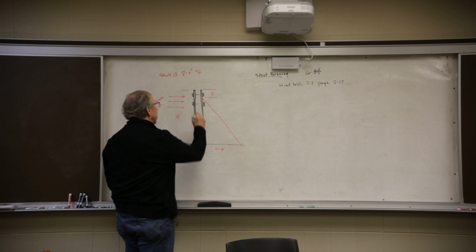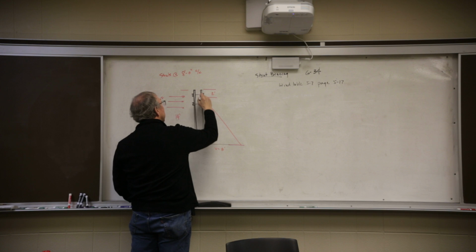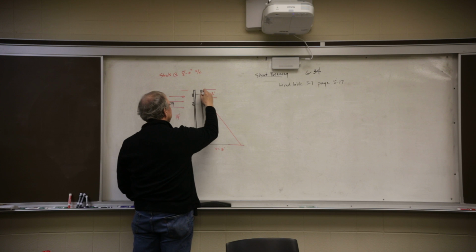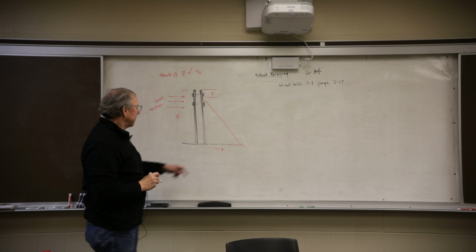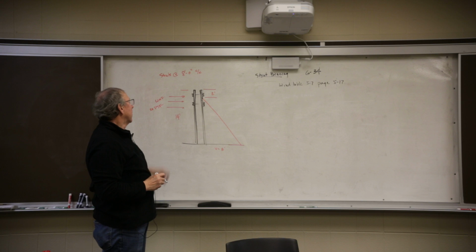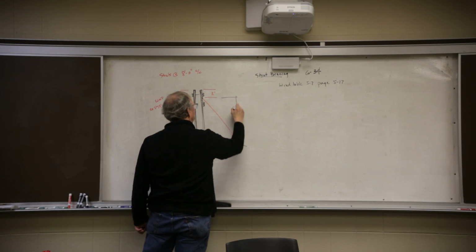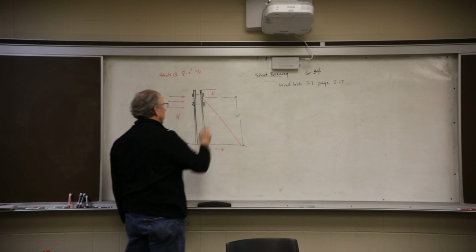So there's our strut. In this particular problem, the strut connects to a stud at a point 2 foot down. So you've got your whalers, you've got your studs, this is actually the stud, the sheathing's right here on the inside. Tie it to the stud; they kicked it out at the bottom 8 feet, and it was 2 foot from the top of a 14 foot wall. So this point right here is 12 feet above the grade. So the triangle is 12 by 8 right there.